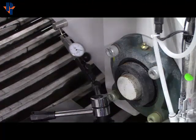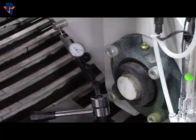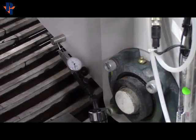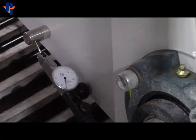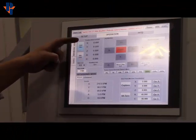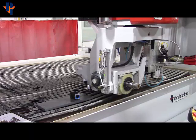When starting the Nozzle to A, you're in a very tight area. Watch the bolt here — make sure you don't hit the miter box in any direction. If you do bump it, don't get frustrated; just restart and try it in a different position. Drive your Y negative until you hit, then run your Z up and down to find the high spot. Use the one thou and Y negative to get to your zero. That dial may jump a little bit — that's totally normal. Hit the user zero button to clear all these values out.